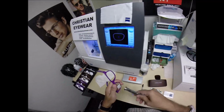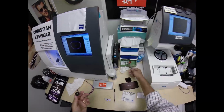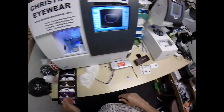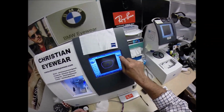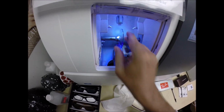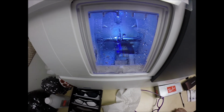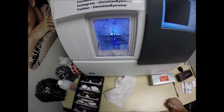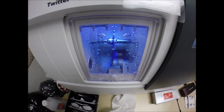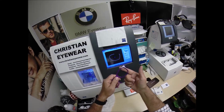So we can go ahead and take this block off, use my hand-approved drying method, put that back in there, add to my sticker collection, grab the left lens, flip that over to L, place the magnet into the Chuck, the Charles, the Chucky baby. Hit the green start button, the door closes, the clamp shuts. And now it's going to trace, just like before, the stylus is going to trace the shape of the left lens, making sure that it's large enough to go around first time around.